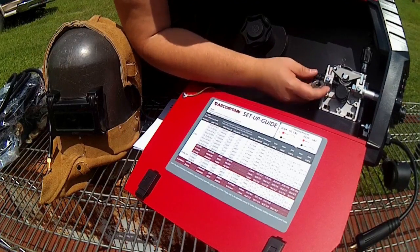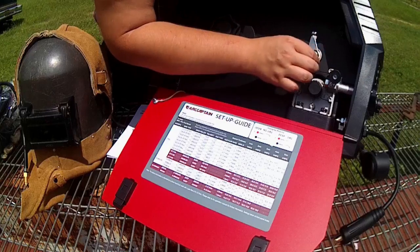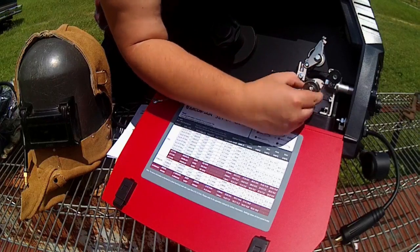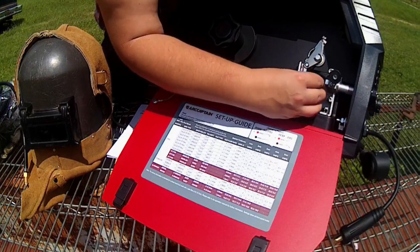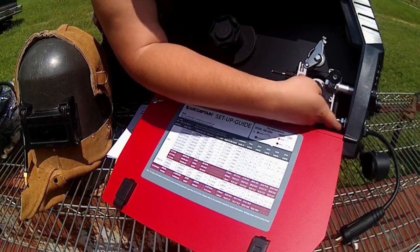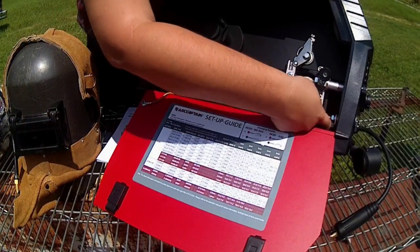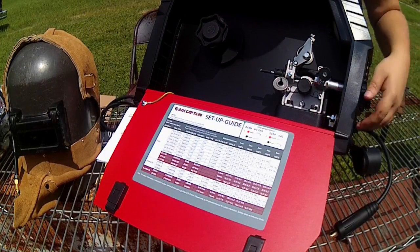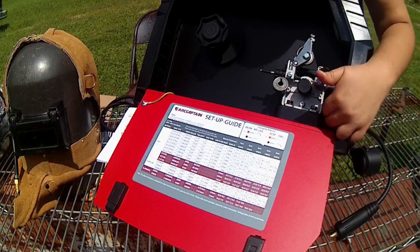Now we're going to get a little bit more into the meat and potatoes. We got more drive rollers here. Nice steel roll drivers. These seem like the same type of drive rolls that the Vulcan welders use. I've talked about those in the past a bit. Pretty simple design. A quick thing about cutting costs is right in here. I don't know how well you guys can see that, but we have a jump bar where we're going to be connecting from our power inside the machine to the stingers here. It is kind of like a tin or steel piece put in.